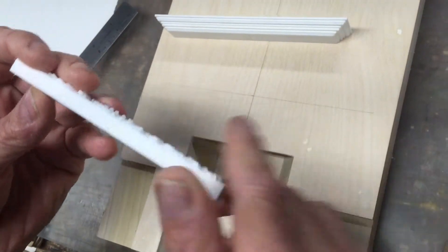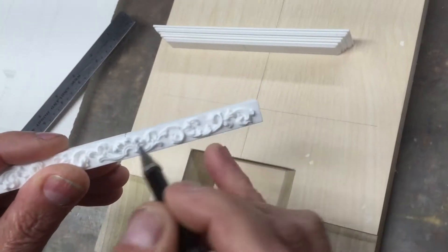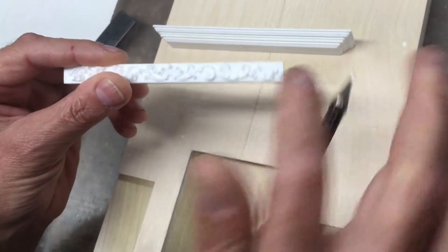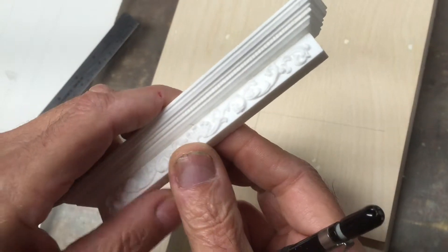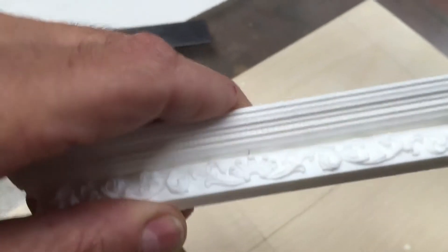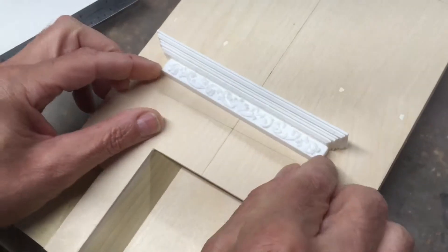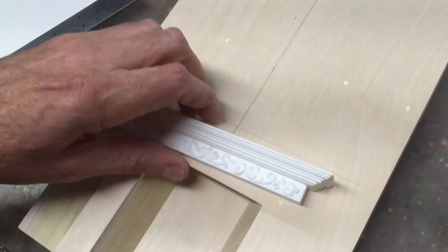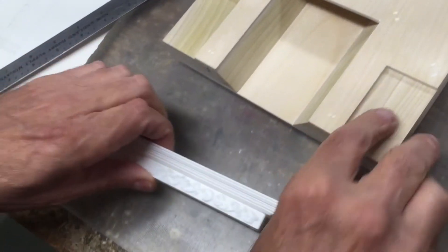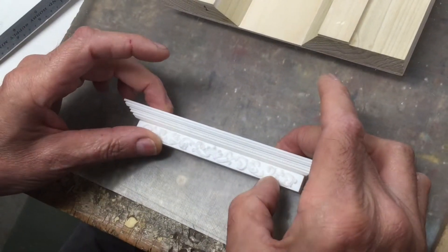What's going to happen is when you've got this mark, you can pull that mark onto the face. That mark will eventually line up with the center line mark on your mantel casting. So there's going to be no back and forth trying to figure it out. You've got a nice center line, and you will also end up working on a nice flat surface to glue that together.